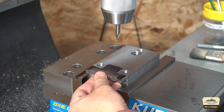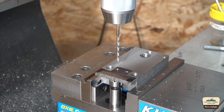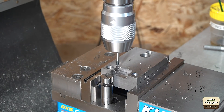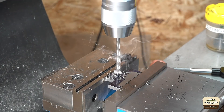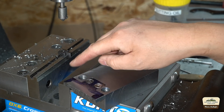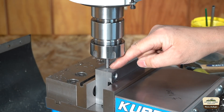We're gonna work on mounting the front bumper to the base, do some additional milling, and then take it to the rotary table to machine a radius on the front bumper. Looking pretty good.